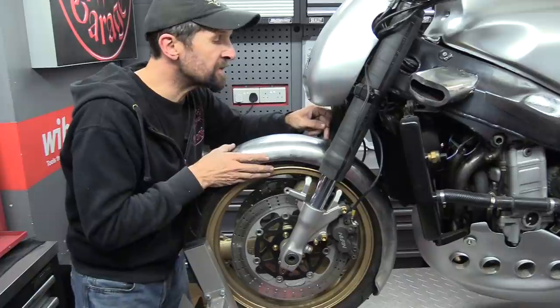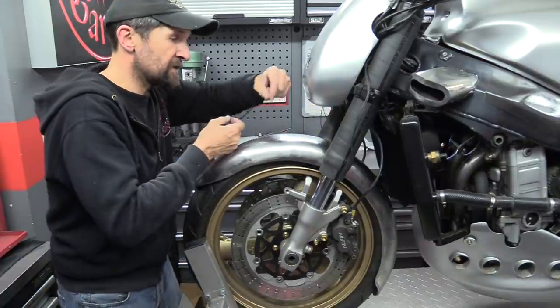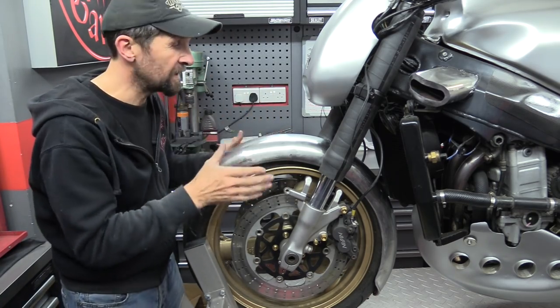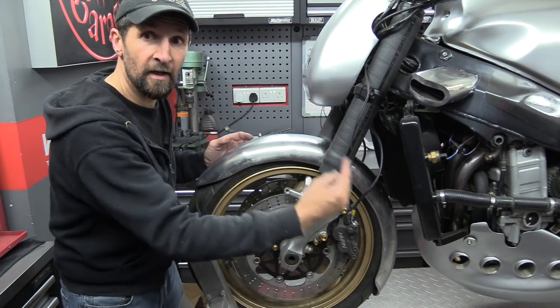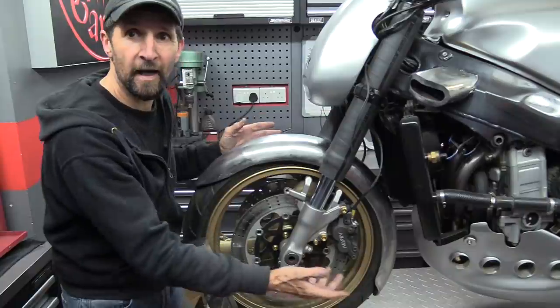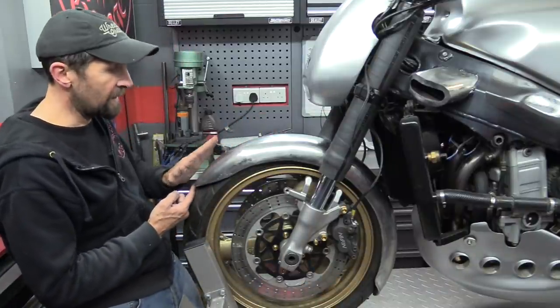A little tiny grind on one side, just a little piece of material out of the way, and that would be almost an airtight joint. You can just seam weld that right the way across, a little bit of strength on the inside, a couple of bits of sheet plug welded just to keep that absolutely strong - and then that's one mudguard. I love it - kind of Arlen Ness style. All the way down to the ground at the back. I want to keep this look down the front too.